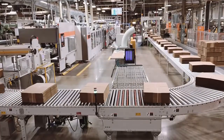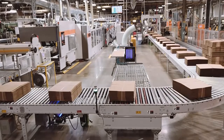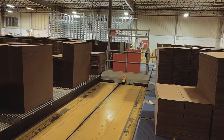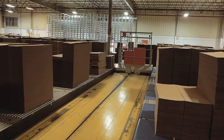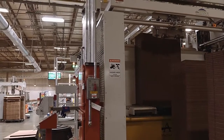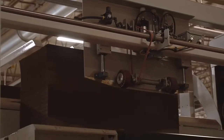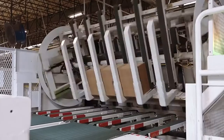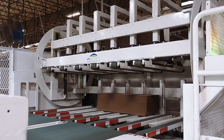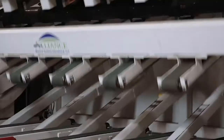The beginning of the flexo process is very similar to that of the rotary die cutter. Stock is fed into the conveyor by the automatic transfer carts and each stack is broken down into blocks. In this flexo machine, the printing is done on the top of the sheet, so the stock must be inverted. The stock is transferred to a pre-feeder where the stacks are inverted — this automation eliminates the need for manual inversion.